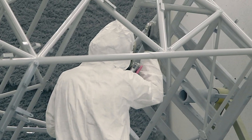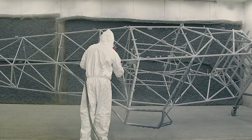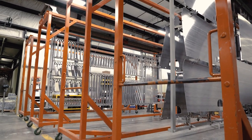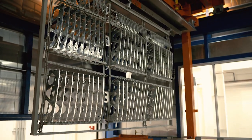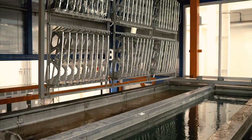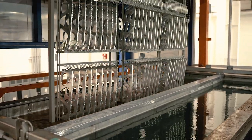The 502B fuselage frame is now inside one of our paint booths getting its paint. Aluminum skins for the wing, fuselage, and 95% of all aluminum parts in the airplane receive an electro-coated primer in our automated e-coat facility. The e-coat process provides an incredibly uniform primer coat that maximizes paint adhesion and provides a longer-lasting product.